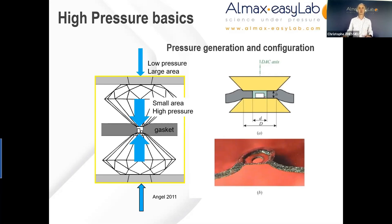A hole is drilled in the middle, and the hole is really the pressure chamber where the sample to study is located alongside a pressure transmitting medium — be it solid, liquid, or gas — and often a pressure marker such as a small piece of ruby. We can also see this in the close-up views alongside a cross-section of the gasket. The diamond anvil cell itself is a device which will create the force at the back of the diamond table. There are different types of pressure mechanisms, and I will come back to this later.